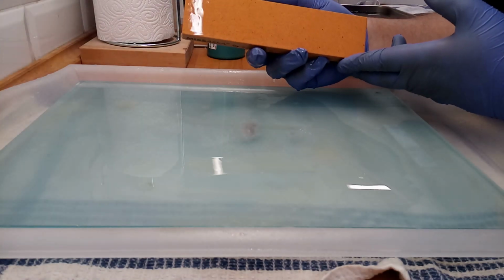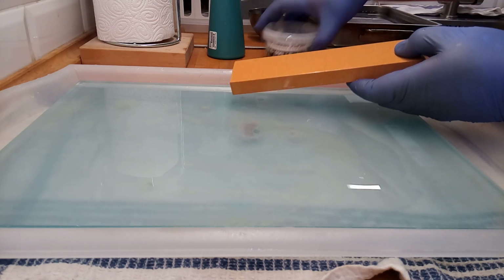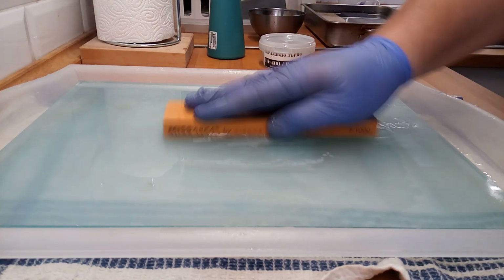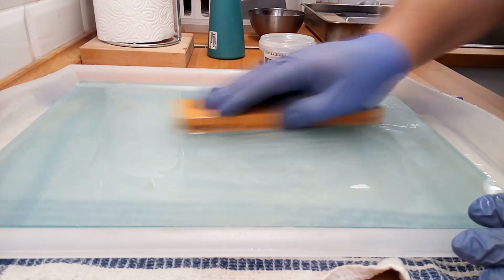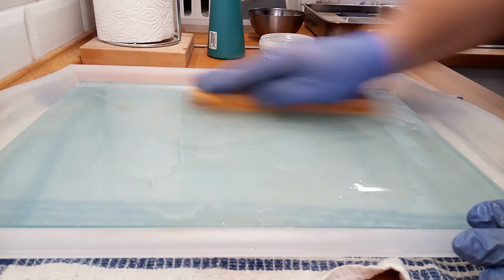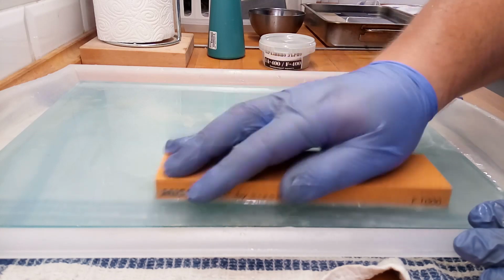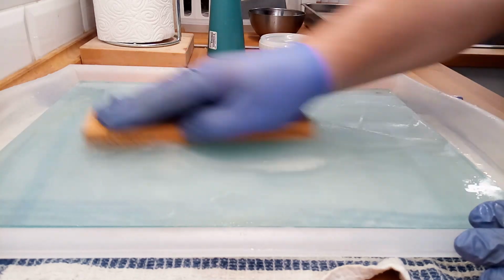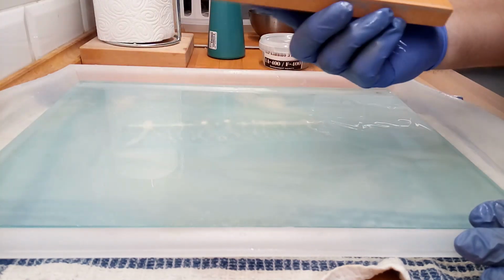And now when the stone is flat on both sides and the edges are chamfered, it's time to finish on 400 grit silicon carbide abrasive grain, just to condition the stone, being FEPA 1000 or Japanese industry standard 3000. In my opinion, 400 grit is just right for conditioning the surface. And that's enough.